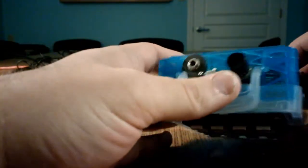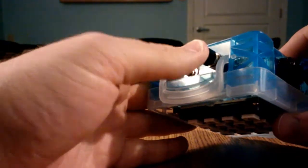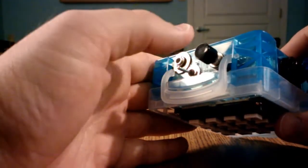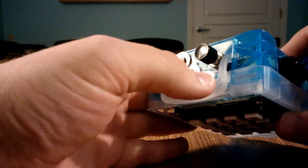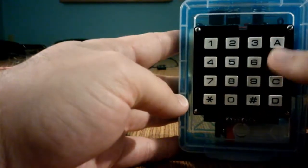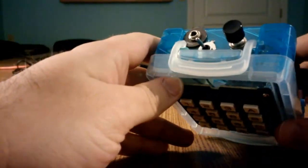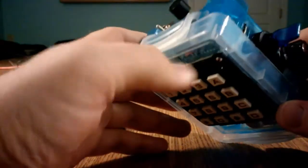And the final thing I added up here at the top is the supervisory signaling button, which in domestic mode is the 2600 hertz button. I did this and basically freed up the button that was being used here, the A button for 2600 hertz, because I've added different modes, which I'll show you in a second.